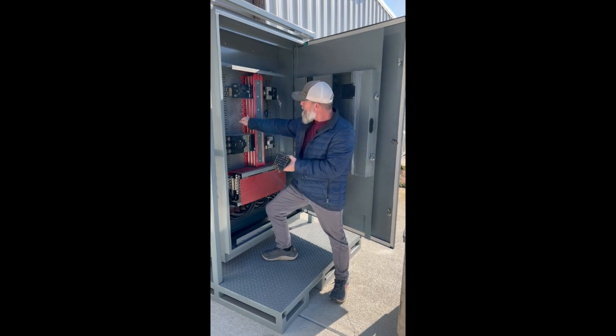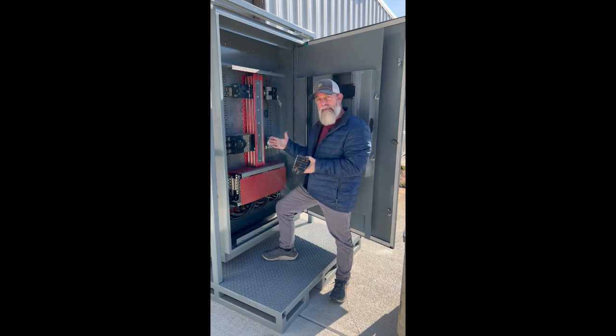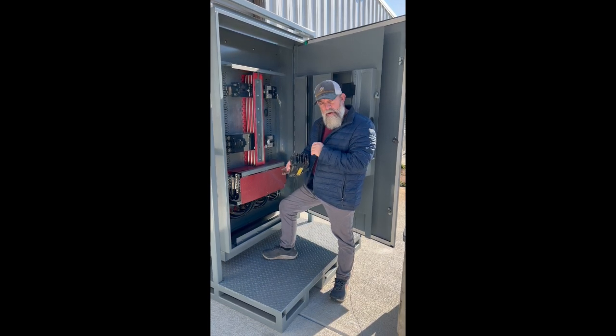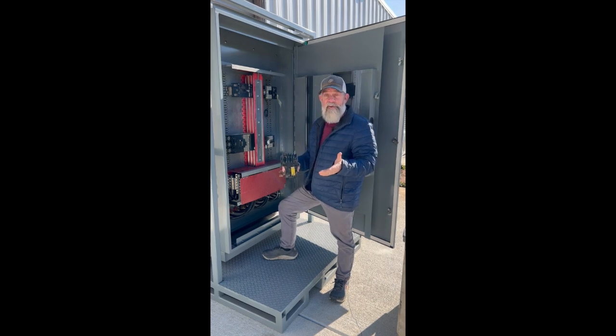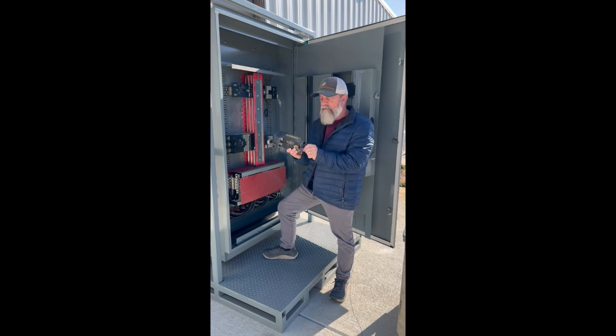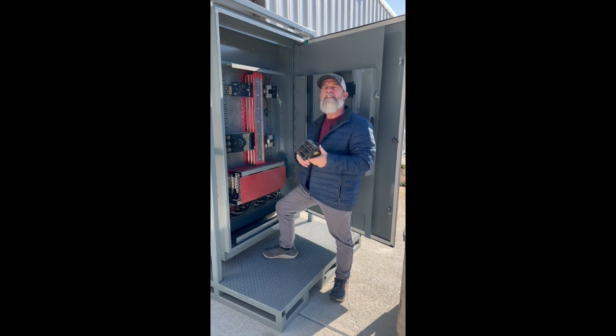The jaws — what we call the crown section — that's where the jaws actually mount onto the silver conductor inside the panel and connect to the line power. These have way too much grease. More is not always better when it comes to grease. Clean it off with alcohol, give it a good housekeeping, then reapply a thin coat — I use a red GE grease, I like that stuff, a thin coat goes a long way. Reinsert it, make sure it slides in and out properly, and don't forget to install your retainer screw as well.